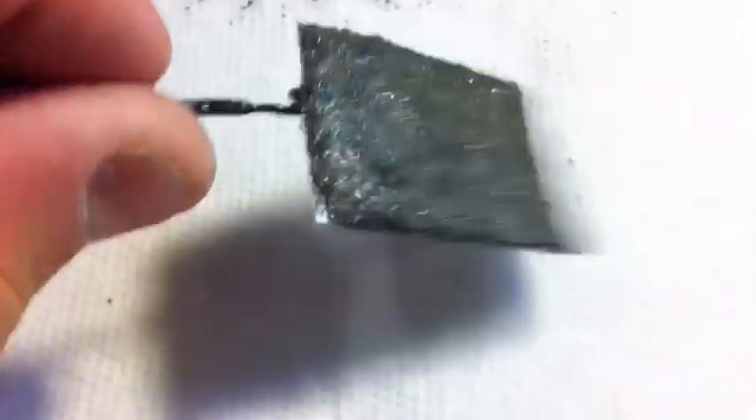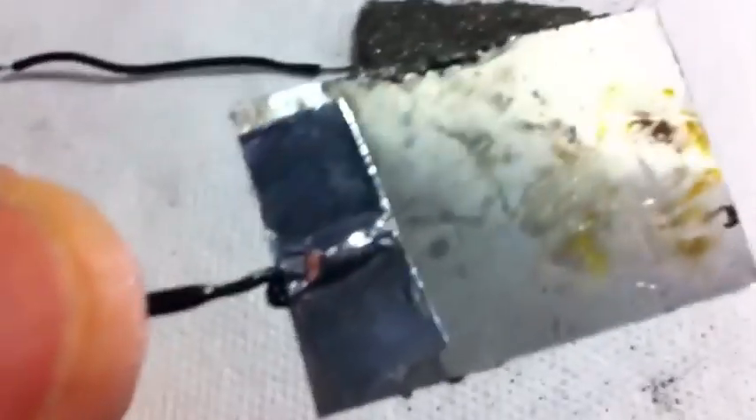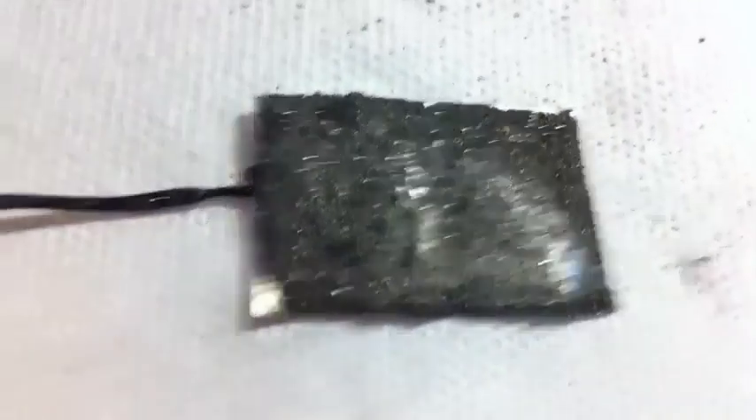My next test: I decided to take my thin sheets of magnesium — very thin. They corrode pretty fast, which is what I want. I used this as my testing base, as I showed before. I cut those magnesium sheets, sanded them off with a drill, polished one side on all three cells, and then I poured sodium silicate. On top of that I put iron pyrite — I ground my iron pyrite rock for this.